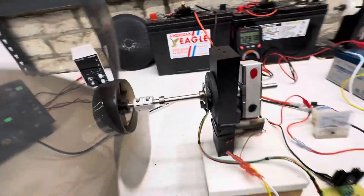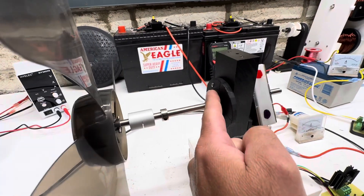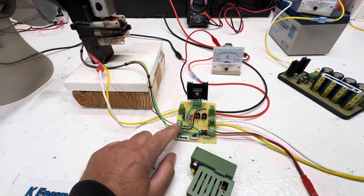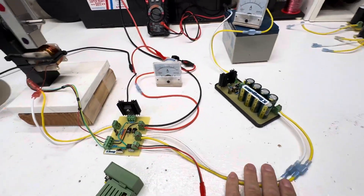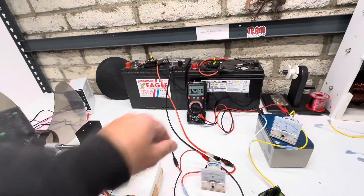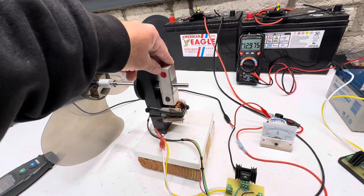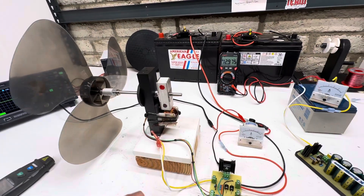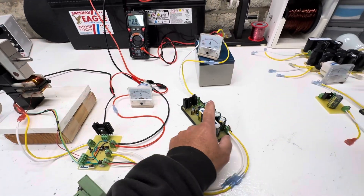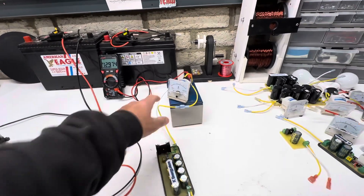I have the optics up here — here's the optical timing. There's just one notch here and one notch there. I have my typical MOSFET circuit, and then the output of the motor goes into my cap dump, charging this battery. We're just running on 12 volts. Every time this gets to the zero point it turns off and makes a high voltage spike — like 300 to 400 volts. The circuit collects it through the diodes and into the cap dump, which charges up to 16 volts and then discharges into the battery.